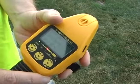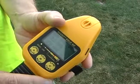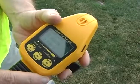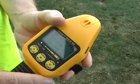ON reading is a sustained reading. PK is the peak or accumulated reading. The countdown timer is set for 45 seconds to provide consistent sampling for each bar hole test. All readings are in percent volume.